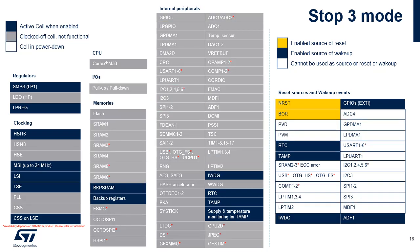The BOR is always available in Stop 3 mode. In Stop 3 mode, the input outputs are in floating state by default. The input outputs can be configured with either a pull-up or a pull-down, or can be kept in analog state. Some input outputs used for JTAG and serial wire debug can only be configured to their respective reset pull-up or pull-down state during Stop 3 mode, or configured to floating state. The RTC outputs on PC13 and PB2 are functional in Stop 3 mode. PC14 and PC15 used for LSE are also functional. The 24 wake-up pins, multiplexed on 8 events (wake-up 1 to 8) and the 8 RTC tamper pins are available. When exiting Stop 3 mode, the microcontroller is in run mode, range 4.